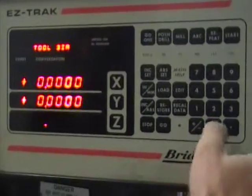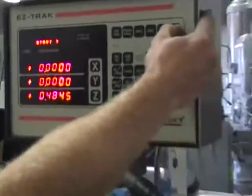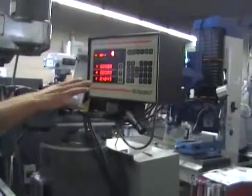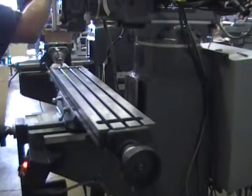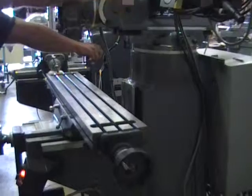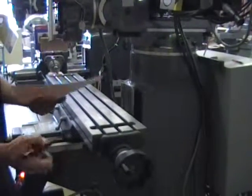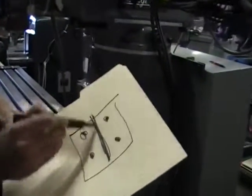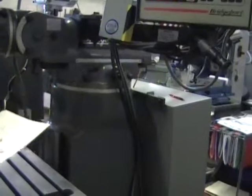If I hit start, it's asking me for a tool diameter. I'll say a quarter inch tool diameter. Now it's just asking me to start. So when I hit start, it's asking me to check my Z — it's up. It's gone to zero, zero, because that's where I told it to go. And if I hit go, as you see, it's feeding. So if I have my mill down here and a piece of material and I want to mill a slot, it's going to mill over. It did the two inches back to zero as I told it to do. And that's as simple as it is to program one shots. You can do cycles as well — if I want to program that line afterwards, I could have just kept programming and it would have gone through that cycle. So that's a very simple control to use.